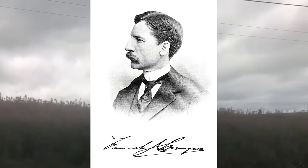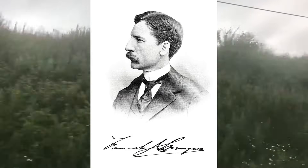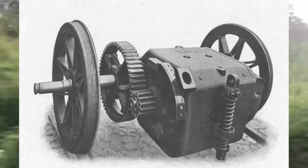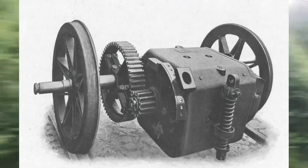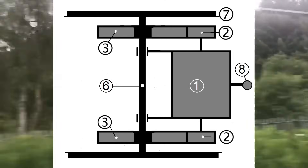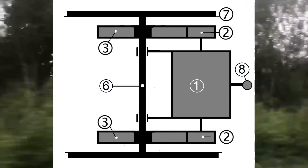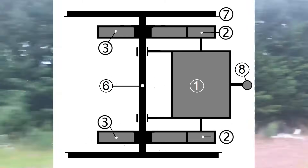Requiring the equipment to be mounted on the car floor and susceptible to snapping if too heavily stressed. With the growing popularity of electric tram cars in Western nations, the need to overcome these issues was now becoming a serious deliberation. Enter Franklin Sprague, an ex-officer in the United States Navy and a member of the Edison Institute. In 1885, Sprague would devise a mounting which would allow for the traction motor to be contained within the undercarriage of the tram car, suspending the motor between the bogie frame and the axle, with the energy transferred via a reductor gearbox to alter the amount of torque necessary.